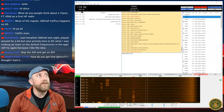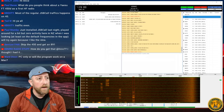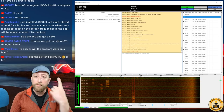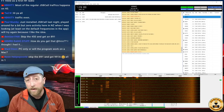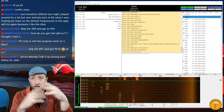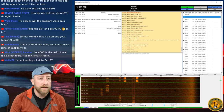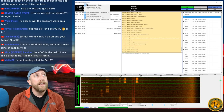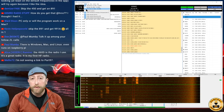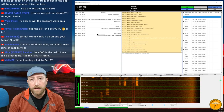To get the HRCC group: go to File > Settings, under Call Sign Groups add '@HRCC' comma-separated, then click OK. JS8Call works on PC, Mac, Linux, Raspbian for the Raspberry Pi — pretty much everything. JS8Call is built with many of the same features as FT8 — how the data is transferred and encoded is similar. It also has a Fast mode and Turbo mode, similar to FT4. The standard mode uses a 15-second FT8-like data throughput.